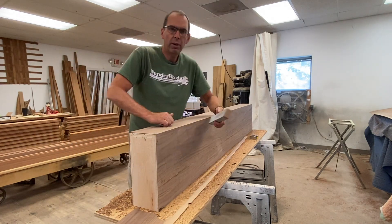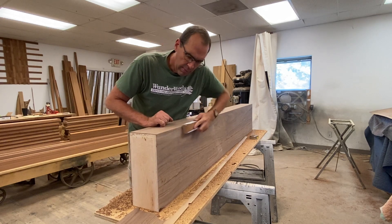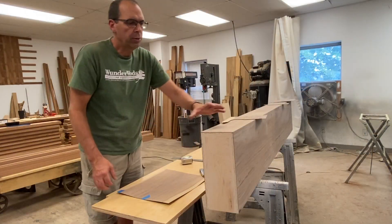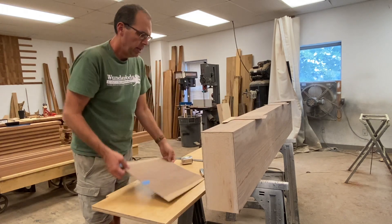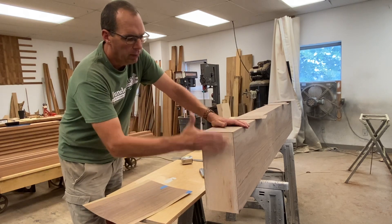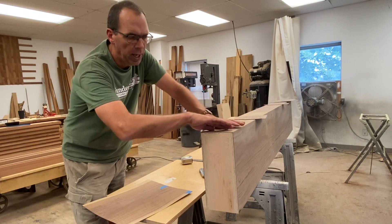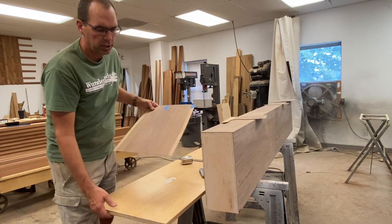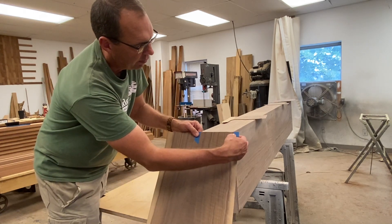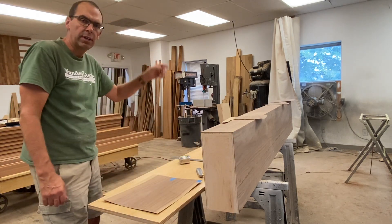I'm just going to push it down and roll it on my little block to keep it nice and flat and straight. I've got the three sides wrapped and I'm doing the ends. These pieces weren't long enough to do the end in a waterfall so I had to go to the next piece of veneer. I bookmatched it, opened it up, and then found the closest match I could to continue around — so this is going to go right about here, and then I'll do the same thing on the other end.